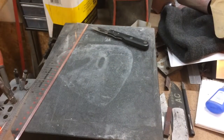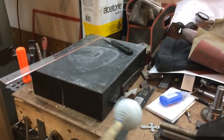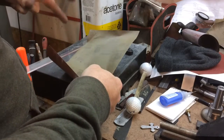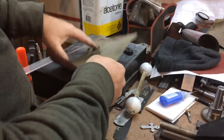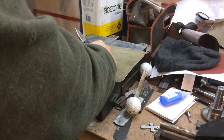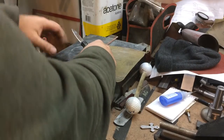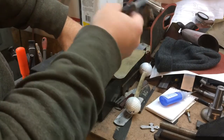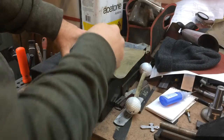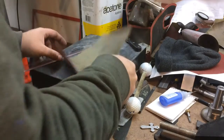Just to show you how I use this, we'll go ahead and get a piece of paper cut for it. I'm doing a fairly narrow blade — you obviously want the strip of paper that you wrap around it to be at least as wide as the blade you're hand sanding. I like to use this ruler just as a straight edge, line the outer edge up like so, and then using the back of a knife — you could use a Stanley knife, a pocket knife, or really just anything with a kind of a hard, sharp corner — you just want to run it down the side there to give the paper a little bit of a crease.